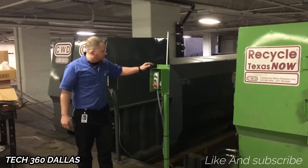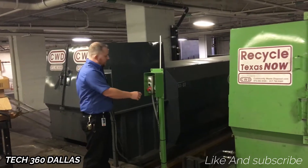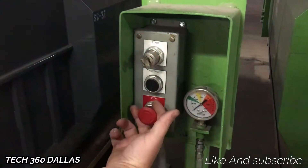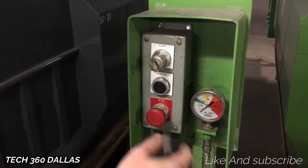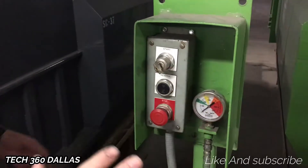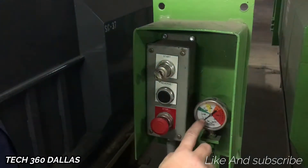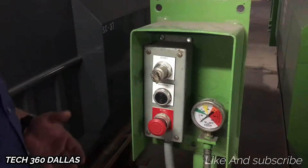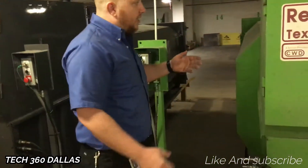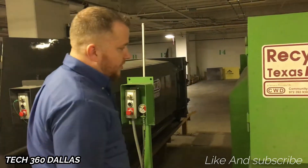So first we're going to start off with the gauges here. There's a gauge in here — if you come up closer you'll see. Basically once you get your stuff in there, you can hit start and that starts the whole process. You've got a stop and an emergency — so in case something happens, somebody falls in or anything, you can hit reverse and it backs it off. Now this gauge here: when the compactor is pushing and compacting stuff in, right before it stops and comes back, wherever that needle hits pressure-wise gives you an idea of how full the compactor is. So you either get it emptied or it's just jammed up — if you see this thing going to the rim and there's hardly anything in it, that means it's jammed up and needs to be worked on.